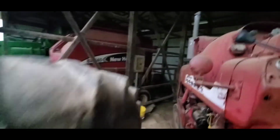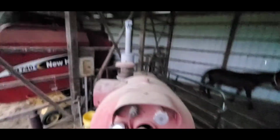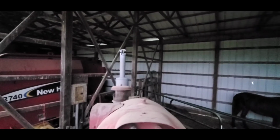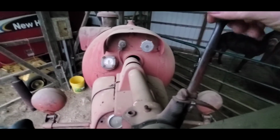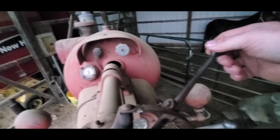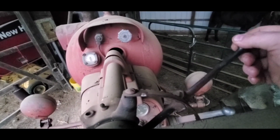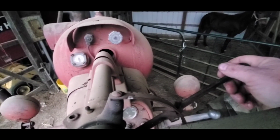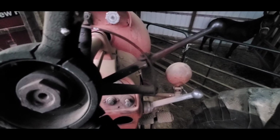Was that for a ride? Yeah. Anyhow, what was I saying? Oh yeah. I need to get my tack out, my handheld tachometer, and actually set the running speeds on this, now that the governor spring is correct. See there, I'm way down past the stop. And I've got that much just dead movement. And then another 3 clicks until I get any kind of governor reaction, and by that point I'm 2/3 of the way down the quadrant.